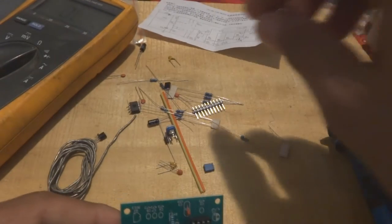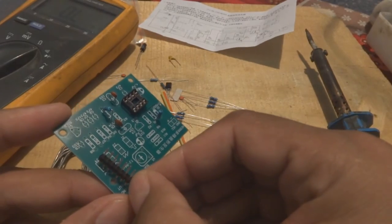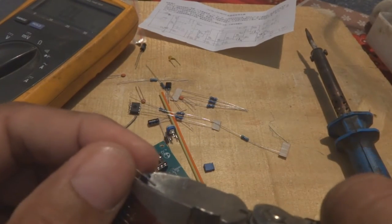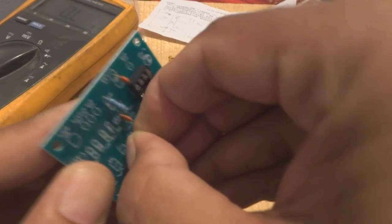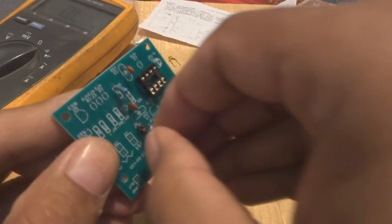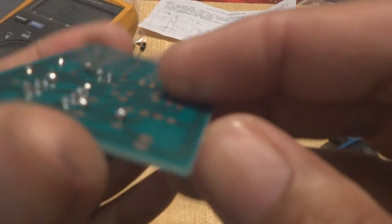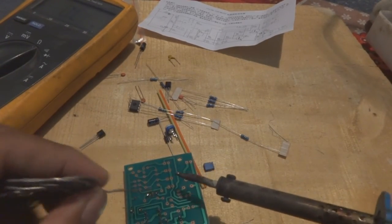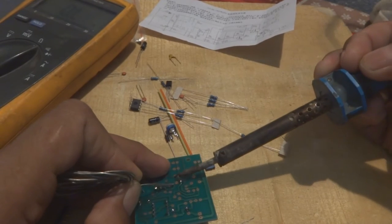And then another component is these strips, which look something like this. We have to cut two legs of these terminals like this, and then put them in for the jumper. A little jiggling is required, as it is a little hard to go in, and we will put it in the way it should be. On the other side you can see they have come off, so they should come off the board. They should not be midway, with you soldering on the top and the solder not reaching the pin, because later you will create a loose connection and the entire circuit will not work.